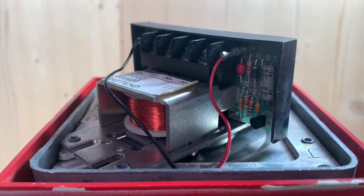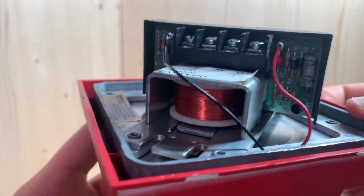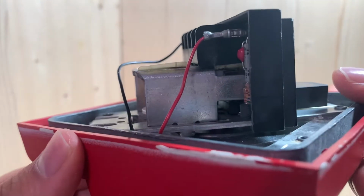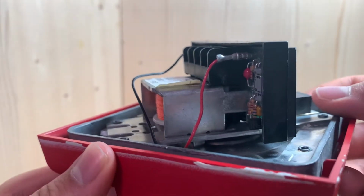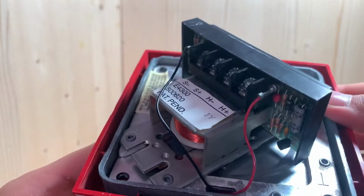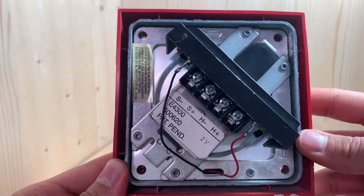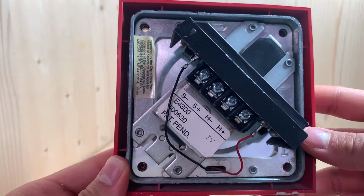Taking a look at the mechanism itself, for those who don't know, in very simple terms, by sending an electrical signal down to this hammer, it strikes this shaped piece of metal and gives you your slightly raspy but very loud horn tone. Electronic horns have a very hard time replicating this tone and it is very distinct when set off.